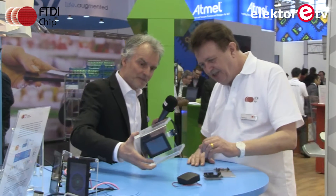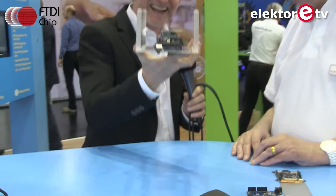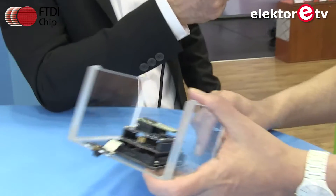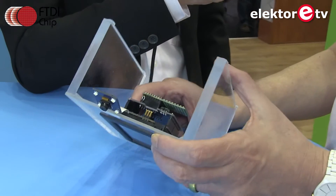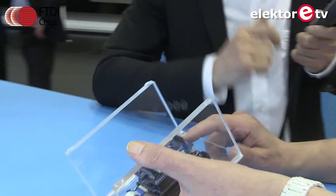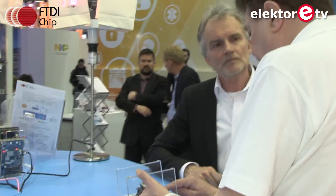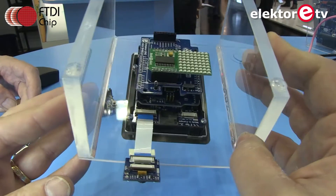There's a big stack shown here in a Perspex case on the camera — you can see four levels of boards. Cleo comes with a plastic bezel so you can mount it as shown. Above Cleo we have the Nero providing Arduino functions. In this case there's also an adapter board from Arduino Uno to MikroBUS, which is becoming very popular. On top of that we have a MikroBUS LED matrix card as a demo.